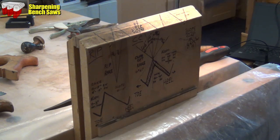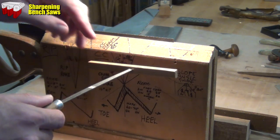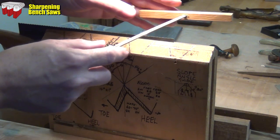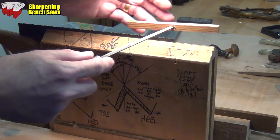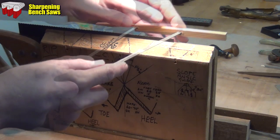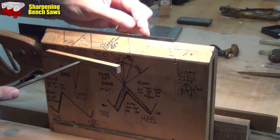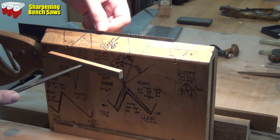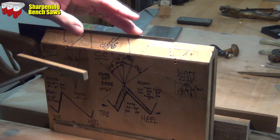With the first set done I'll just turn the saw around the other way, so I'm coming back from the other end. I've reset my guide - the fleam angle is now the opposite way around. The steep rake angle is now on this side of the file, and we'll start in the first gullet. I'm taking longer this time because what I'm aiming at is to see the tip of the tooth almost disappear. It's quite bright at the moment because it's got the area that was filed down when I leveled the top. As that area gets thinner and thinner it almost disappears, and that's when the point ends up on top of the tooth.